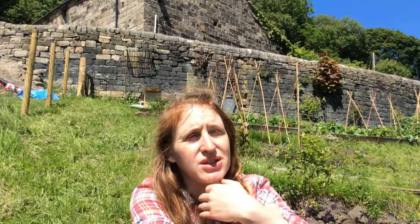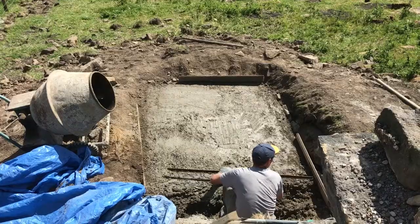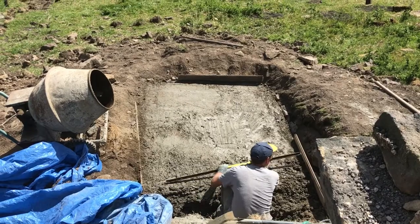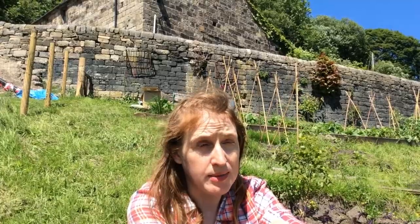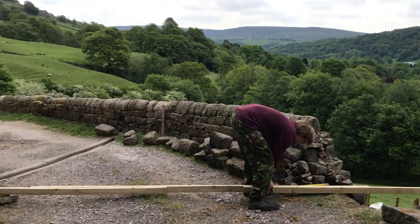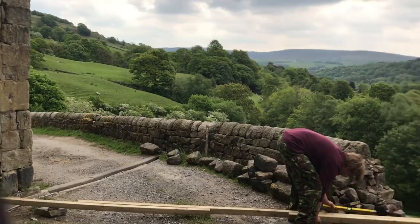You've got to have it seven metres away from the house, and you've got to have it either buried underground on a nice flat surface, or as we've chosen to do, have it above ground and had to make a concrete platform which is very level. So then you need to have, from the manhole outside the house, the sewer pipe to take the waste from your house to the water treatment tank.